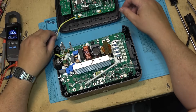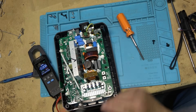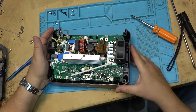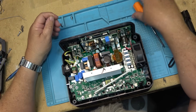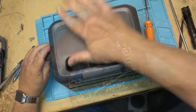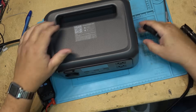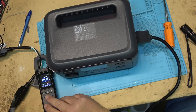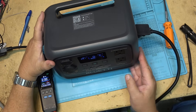Let's start to put this thing back together and reassemble. Even with the screws not in for the battery, it's still energized. If I test here I've got 16 volts, so we've got full power — you've got to be really careful that nothing shorts out. This is when you don't want your screwdriver magnet to be weak when you're dealing with hot circuitry. Last thing for our test is to do a charge and see how long it takes. Plug this bad boy in — it should start to charge automatically. It's at 0% and drawing 289 watts.